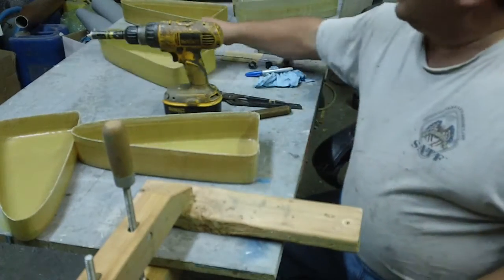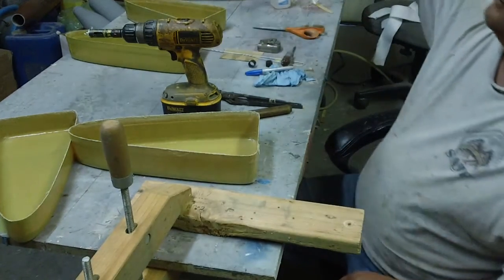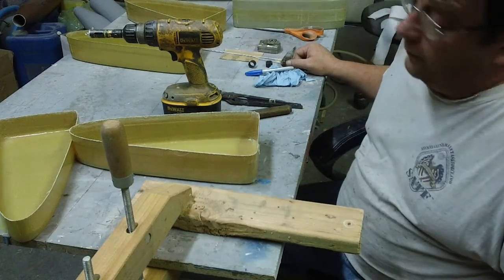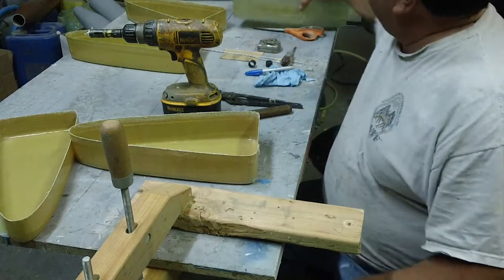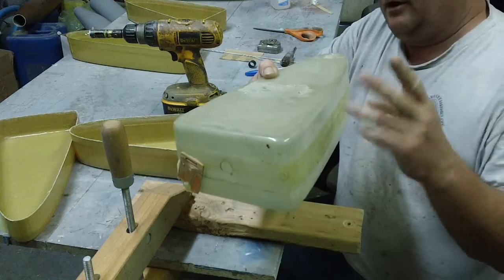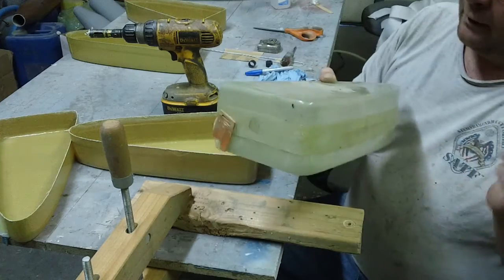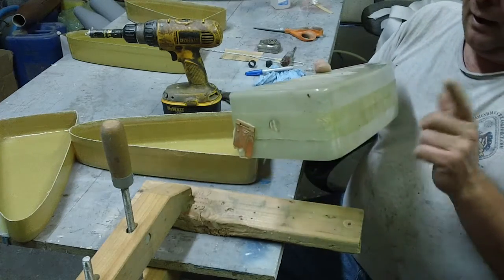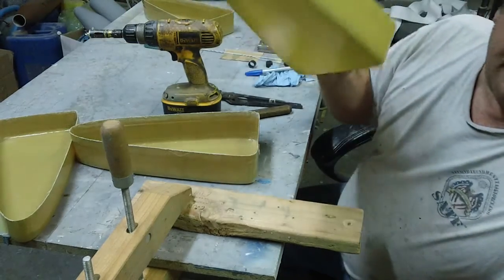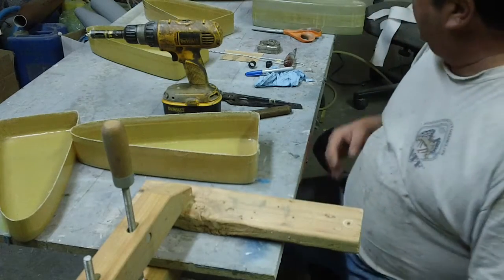I believe it's really nice now. I put two pieces together to weigh it against — and it's a lot lighter. This one is two layers of six ounce and two layers of ten ounce cloth, all wet layup, no peel ply. It did not leak, but it's a heavy tank. These weigh half of that tank. So we're going to knock some more weight off there.